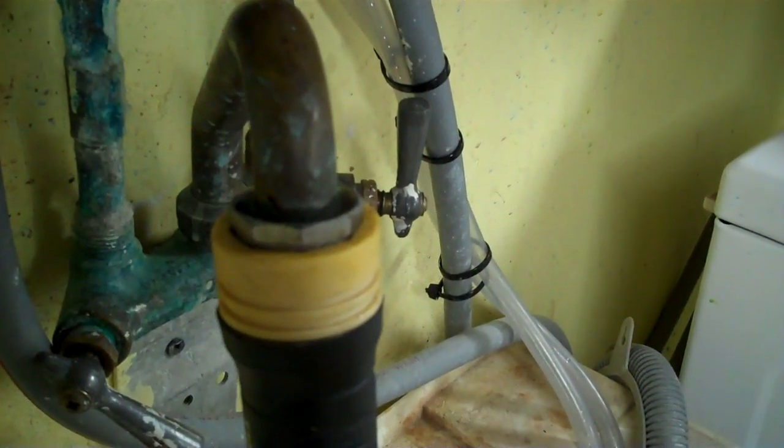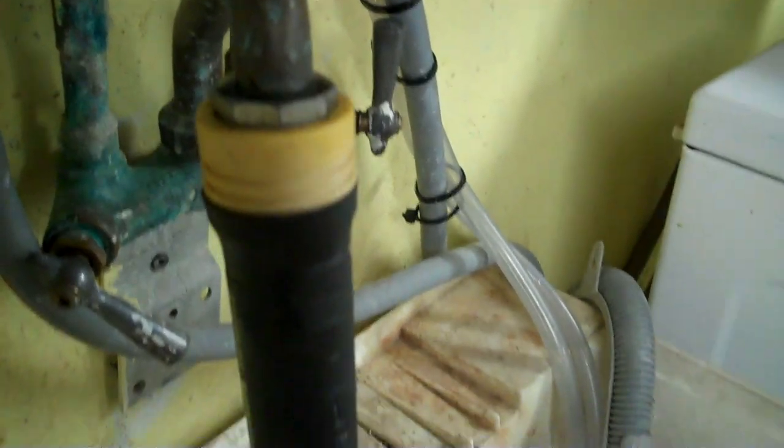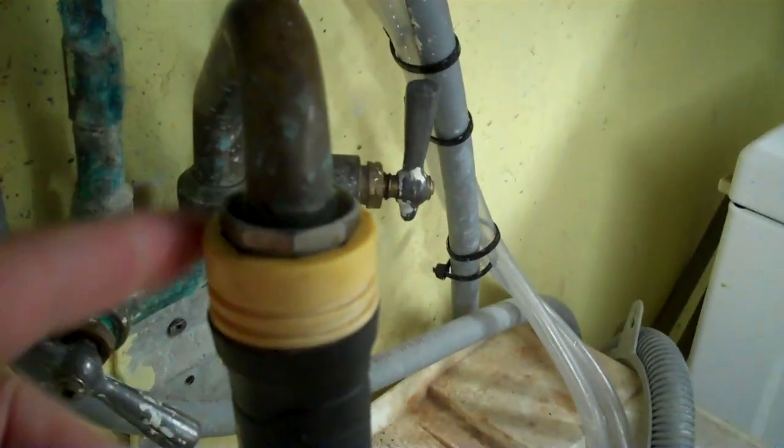Our outside spigots are turned off in the wintertime, so we just put a hose onto our laundry tub. It's got a hose fitting on it. But if you don't have a laundry tub available, take the supply for your washing machine. It's a washing machine right there. Because those are hose threads on it. So if you've got a washing machine in your house, you can fit a hose onto the cold water supply for it and fill your hot tub from that.